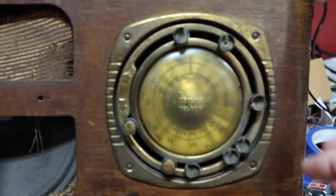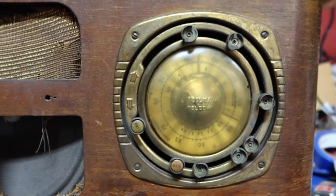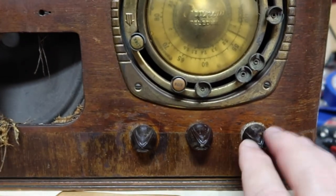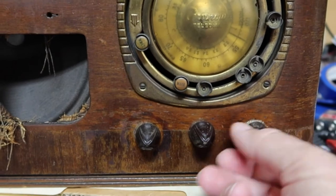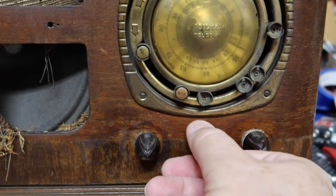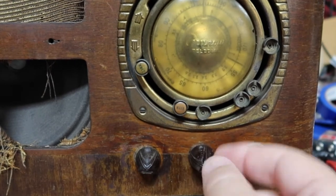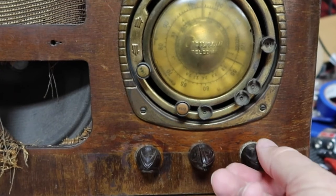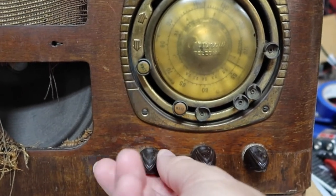Going the other way, it stops at your programmed station. You can preset these at different stations wherever you want to listen. Some of these models had a mute button where it would automatically mute the radio when you push it in, so you didn't hear it scrolling past other stations as you turned it. This one I do not believe has that. This middle switch is a three-position which I believe is shortwave, broadcast, and a mute position so you could mute it — keeps the tubes hot but stops the audio. That's kind of nice.